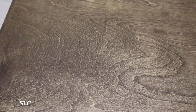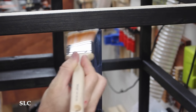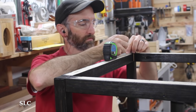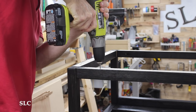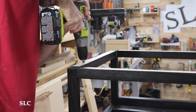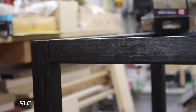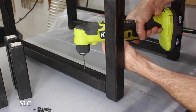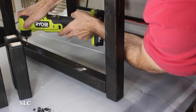While the desktop and shelves were drying, I added a layer of polyurethane to the frame. I always get a little nervous applying polyurethane because of its milky color when wet, but it always seems to dry clear. After giving the frame a little time to dry, I measured out the locations of the screws needed to hold down the desktop. I used a 1/8-inch bit to make pilot holes through the frame so it would be less likely to crack. The best fastener was a 2-inch screw attached from the bottom of the frame so it would not be visible on the desktop. I was limited in space, so I had to grab my 90-degree drill to get those screws started. I also needed pilot holes in the lower frame to hold the lower shelf, but due to clearance issues those screws were added later.